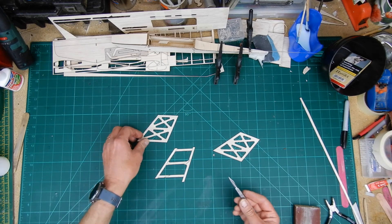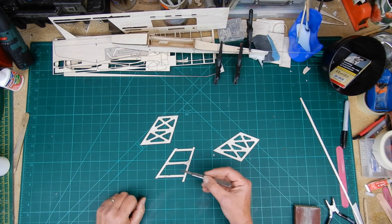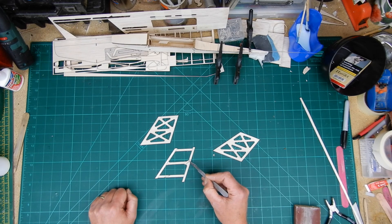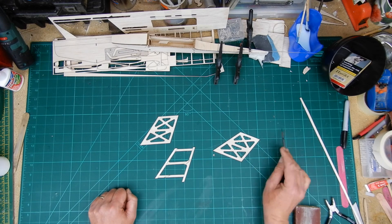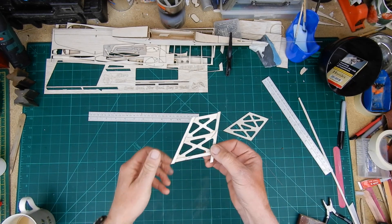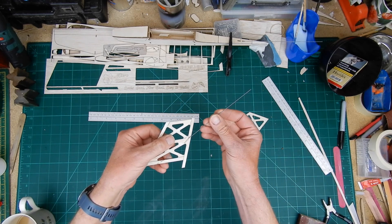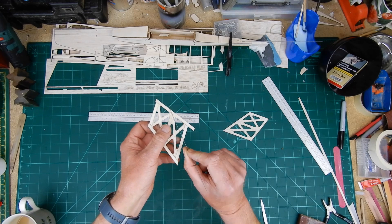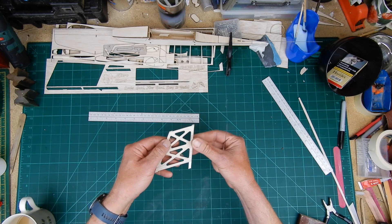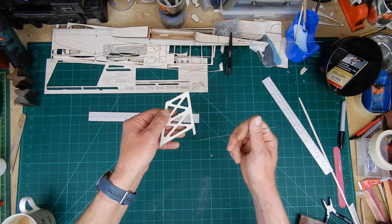I plan to fit these parts onto one side of the fin. When I'm happy, I'm going to loosen off this little bit to allow the tube to feed through, making sure that it's clear all the way through, then add the other side. I've added the intersections on the fin — I'll post a link with pictures of how I've done it. Note how I've left the tags at the top for the tail plane and the tags at the bottom for it to join the fuselage.